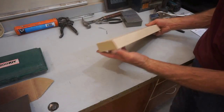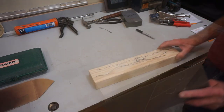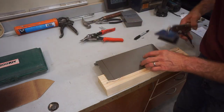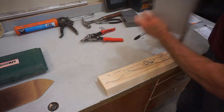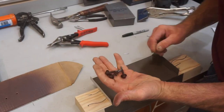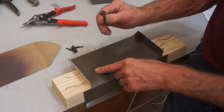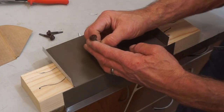With all the supplies gathered, I took a piece of 2x4, ripped a 15-degree bevel on it to use as a mock-up for those old cracked and knotty sills at the house. The bevel on the metal matches the bevel on the sill for a nice snug fit. Once I marked, measured, and prepared the flashing, it's time to fasten it. The typical way to do it would be to use rubber washer-headed self-drilling screws to hold the metal down, which leave a pretty good-sized head on the surface of the metal. So I like the option of reverse riveting for this application a whole lot better.